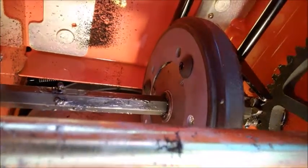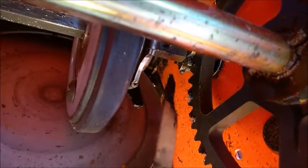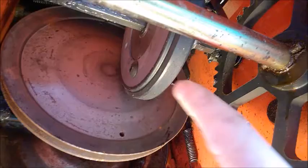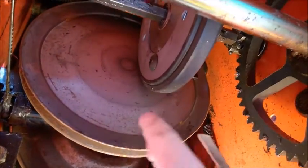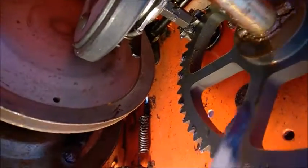Lubricate all around the shaft on both sides of the disc. You can make more space by changing the speeds with the lever. But by all means, do not touch with any kind of grease on the friction disc or on the flywheel — wipe it off with alcohol. Very, very important.